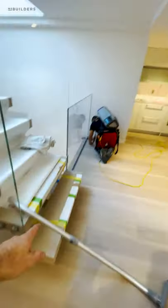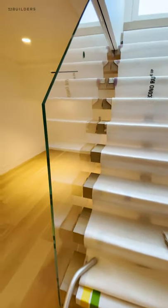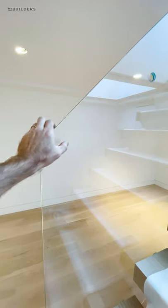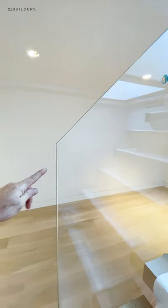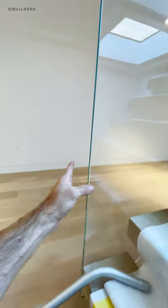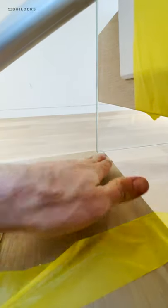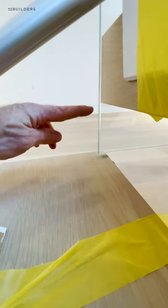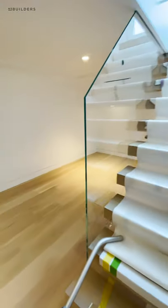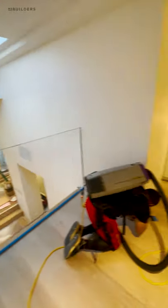Costa just dropped off his stainless steel handrails. This one will come straight down — we've got a mount here. Our handrail is going to be just a few inches from top of glass to top of handrail. That inch and a half will come through the glass and then match over to the stainless handrail — kind of an opposite effect but the same dimension. The handrail will come down and sit right above the tread, like the glass, and stop so it looks like it's floating. We'll come back with a piece of plate steel to catch the backside, so you won't see that plate — it'll look like the thing floats. Should be a really cool detail. Came up with that on site yesterday with Rich — that's the design-build portion of a lot of these details.